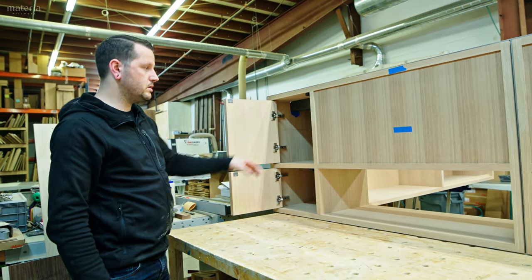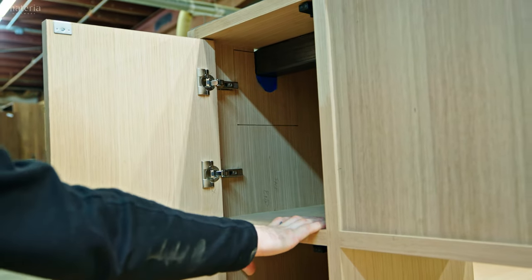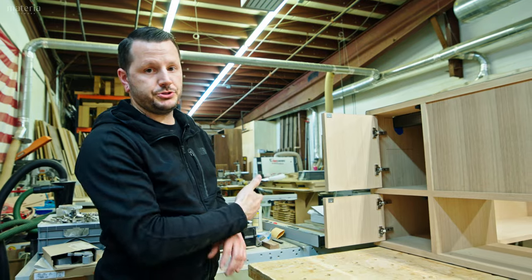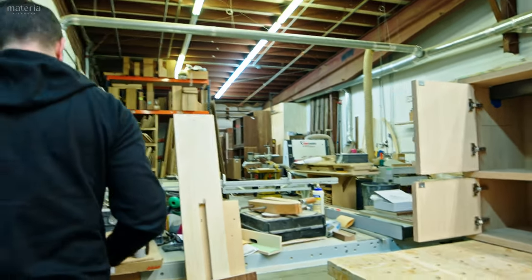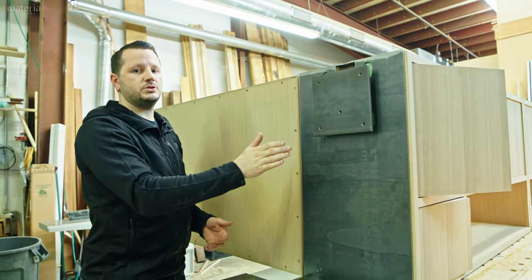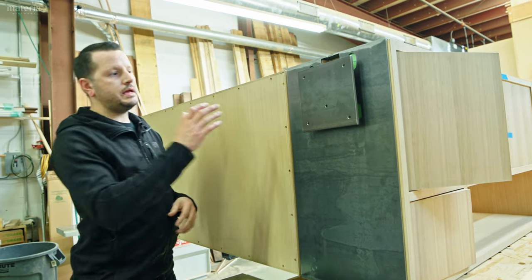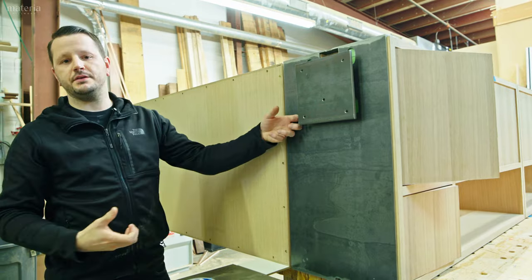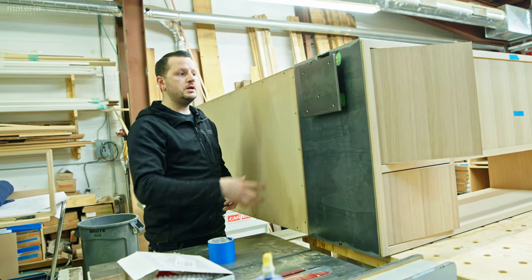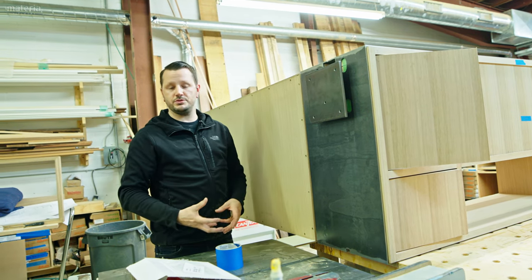There's a line going across here — that's actually an access panel. Once we do get this thing hoisted into place, we can pop off this panel, which gives us access to yet another flange from that beam that we can bolt to the wall. Coming around the backside, this is the part that's actually going to be up against the wall. There's going to be stone — in this case a poured concrete countertop and backsplash — that sits between the face of this metal and the actual wall, which is why this bracket is sticking out so far. The backside of this bracket will mount directly to the framing. We already have substantial blocking in that wall to help support this weight, and there are holes drilled through this steel plate giving us access to bolts so we can bolt everything to the wall when the time comes.